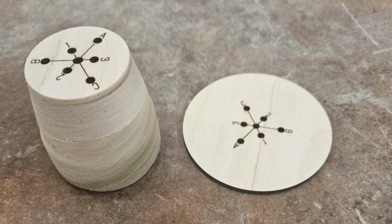The complete system requires a disc on both ends. Holes guide the offset. On the headstock, 2 brass pins drive the project and offsets. On the live center end, a single brass pin provides the offset. Since for this project I'm only offsetting one end on the live center, however, later in the process, I realized that I should have used both ends anyway, since I did apply more pressure and the spindle developed a crack. Using both ends minimizes pressure, bending, and breaking.